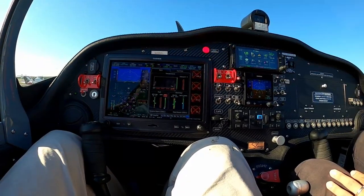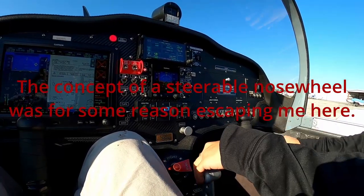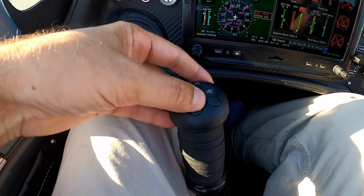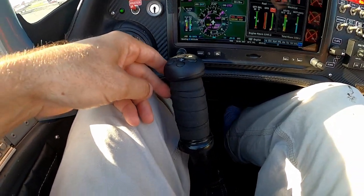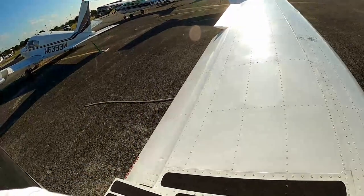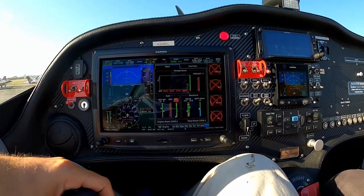The transponder is in the systems here. It's a single brake system — you can't brake differentially; both wheels stop together when you apply the hand brake. Over there we have a trim indicator. The trim tab is right here — you press the button to trim nose down or nose up. The flap indicator shows three notches: 10 degrees, 20 degrees, and 30 degrees.